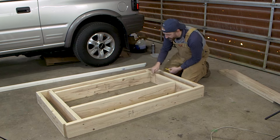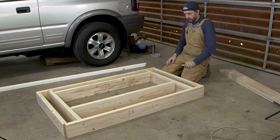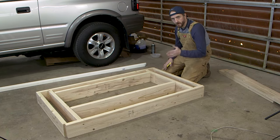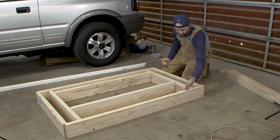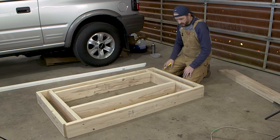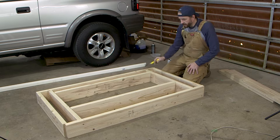So I've got 46 and a half here and 16 and a half here, which should be perfect for that fireplace insert. The manual says it needs a foot of clearance between the top of the insert and the mantel — so that's what I've got here, 12 inches from here to here. When the mantel is on, that will give me the necessary clearance. I think this looks really good, so I'm going to move the outer frame and assemble the inner H.